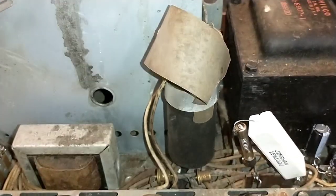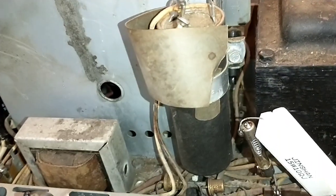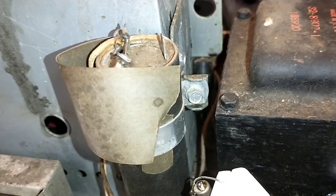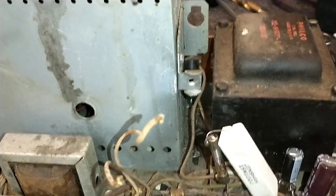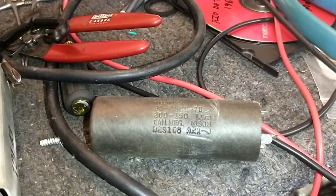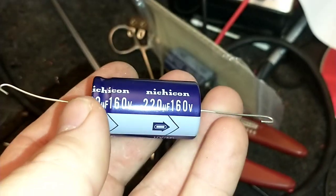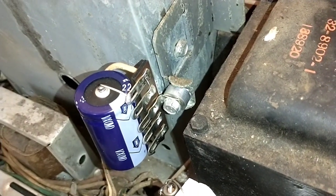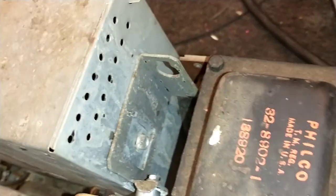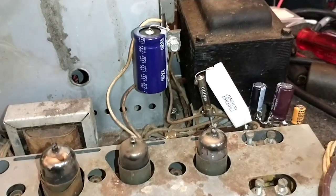Now we can focus on replacing the boost — just one single capacitor, so not really a big deal. It's held in place by this clamp here. That smushed-looking specimen is a 200-microfarad at 150 volts, and it's out with the bracket now. I think I have one of these kicking around. Looks like all I have is this axial version, which I'm used to putting in other sets, but I think we can make it work. That worked out pretty nice — another terminal strip to the rescue. I put a piece of stock tubing behind it to boost it up so it wouldn't sit too close to the cage, then mounted the capacitor to it and wired it up. So that's now two of the three cans.